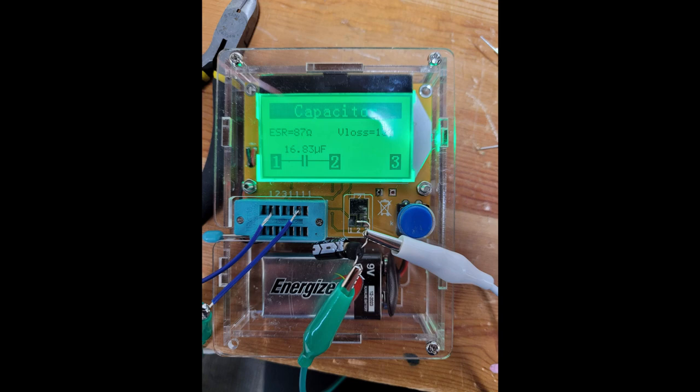Second, with that same troubleshooting pass, I was looking again at my bias circuit, because when I was drawing my layout, I noticed that my bias filter capacitor looked weird. The shell, the printed part on the outside of the capacitor, had kind of come off of the body of the cap, and it was looking very strange. So I decided to pull that out of circuit, put it on my parts tester, and it was reading really goofy. It was reading inconsistent. It was reading really low. Should have been a 50 volt, 50 microfarad, and it was reading like 8 or 16 or 12, or it was off. So I just decided that maybe that had gotten nuked when I had installed it previously, or somehow, and put in a new one in its place.